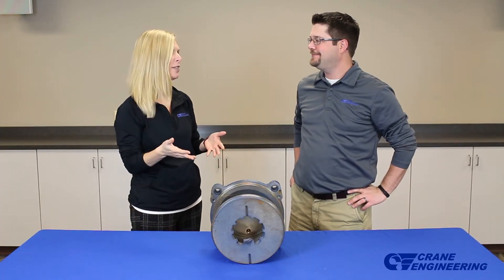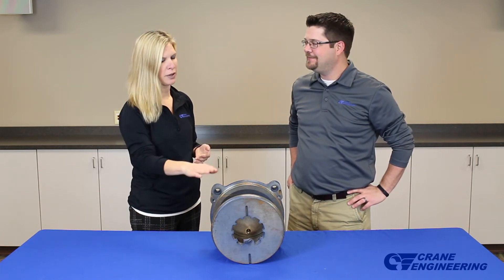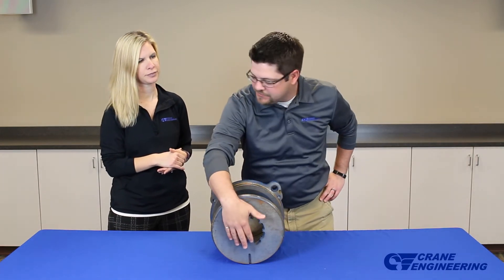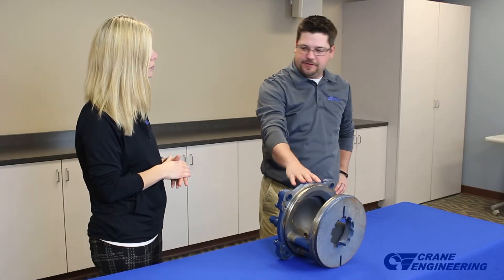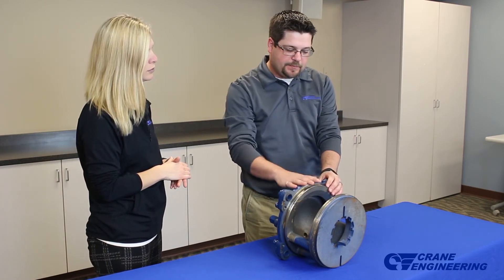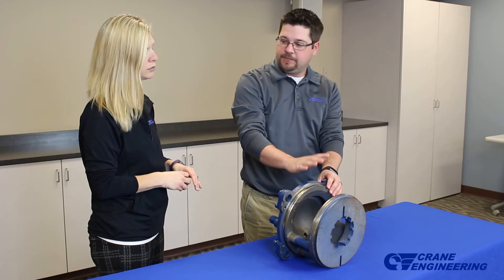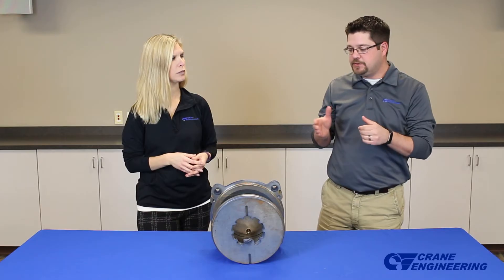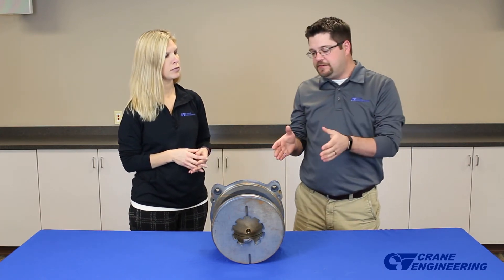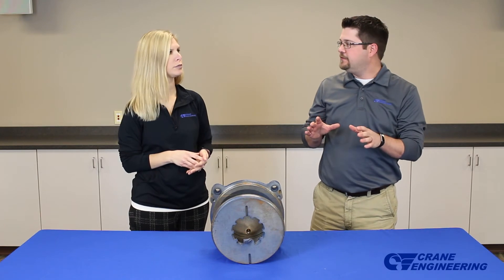So with any upgrade, there's got to be some sort of drawback, right? It's not all pros and no cons, so what is the drawback with installing one of these? So with this enhancement, obviously there's a little bit of intrusion to the flow path behind the impeller. What this causes is just a slight reduction in efficiency. And what Gorman-Rupp has done is said, any pump that's plugged is a zero efficiency pump because it's not working. Reduce the efficiency just slightly, but keep the pump running — everyone's going to love that. So if you ever run across that you're looking to apply this to an existing application, please talk to an application engineer. They'll need to run through the calculations just to make sure that your existing system will work with this enhancement.